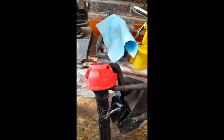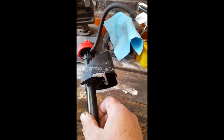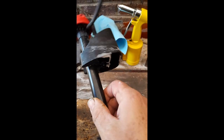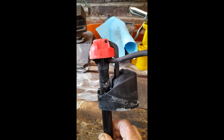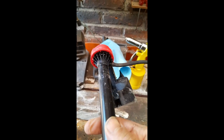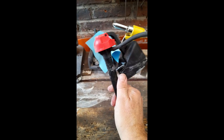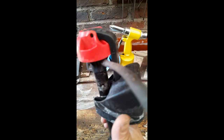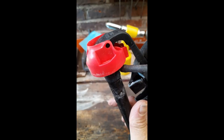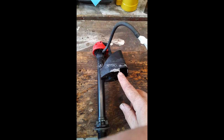Water comes up here. The float here, it's a piece of shit float that came with the toilet. What happens is as the water fills up, it spills down through the little holes here. And as it fills up, this raises like this. This arm cuts off and presses down in a little rubber valve that's inside here.